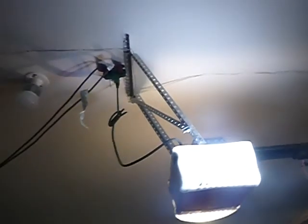This door opener control button is not supposed to be closer to the threshold than 5 feet, to keep the little hands from coming up. And these control wires are supposed to be on insulated staples. Now, this door opener is supposed to be on a GFCI protected circuit. They're advertising GFCI protected circuits in the garage, but I cannot ascertain that the receptacle outlet is GFCI protected. I'm not testing the GFCI in here because this deep freeze is in use, and I can't see where I would begin to reset a GFCI in this garage. I'm seeing lots of labeling, but I'm not seeing the actual device. Also, these extension cords: you should not have extension cords in a permanent application. And if the fluorescent lights stay, they should have protective prism covers.